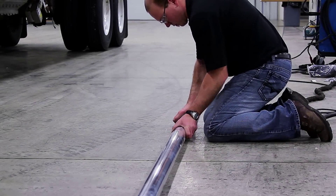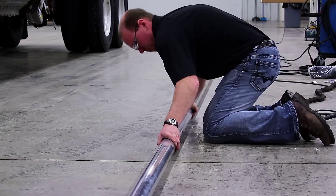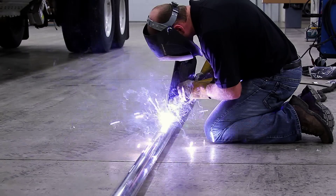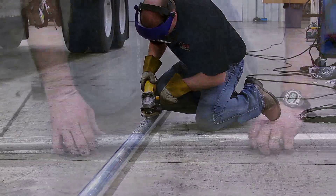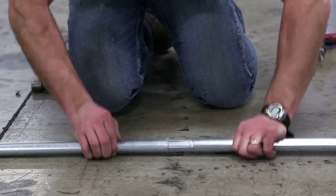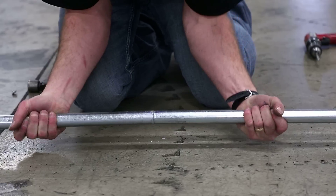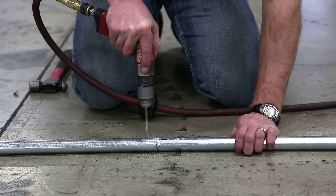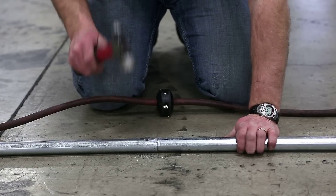Step 7. Insert the splicer tube inside the large roll tube until the two tubes are tightly against each other. Make sure the rope channels are aligned. Then secure the roll tubes together by plugging each of the four factory drilled holes with an aluminum weld. Let the weld cool and grind flush. Insert the smaller end into the standard size end of the 1-inch stationary tubes. Align the tarp rivet holes at each far end of the tube. Drill a 7/32-inch hole through the two layers of the tube wall. Make sure the rivet is fully seated and set the drive pin with a hammer until flush.